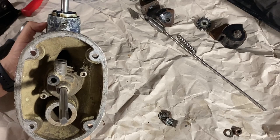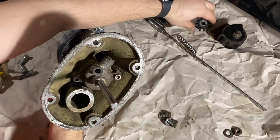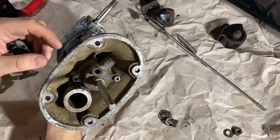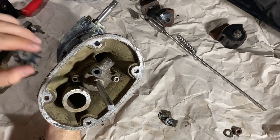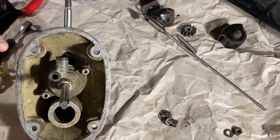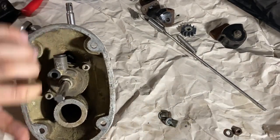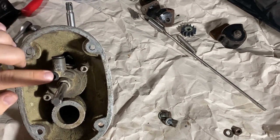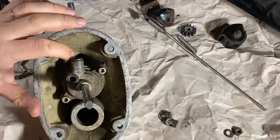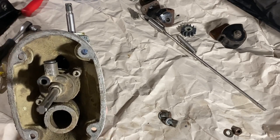This is the lower part. As I said, I have already opened this before. There's this rubber thing inside here originally, but as we don't need coolant water, we don't need this and I've already removed it. Here you can see the water intake - there are these holes below the water, and this actually fills up with water and pumps it up to the motor. That's why we have to seal these holes up, so the water doesn't get up here and into the shell and inside the boat, because we don't have the proper sealants there anymore.